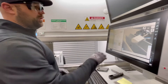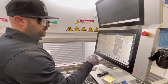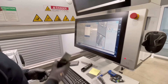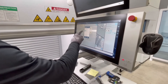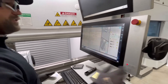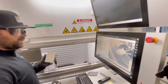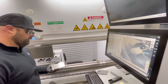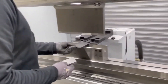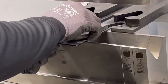TRUMPF has set up a way for us to configure multi-sheet bending with the click of a button. You select it, you add in your thickness of the sheet, which is 0.118 in our case. Now it's going to adjust the tonnage and press force for this particular part, including the sacrificial piece of material that we're going to put in there. So we're going to come in here across our die, place the sacrificial piece — the double sheet — then place our part.